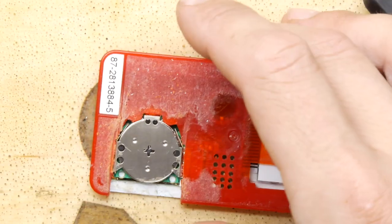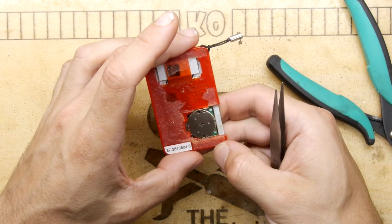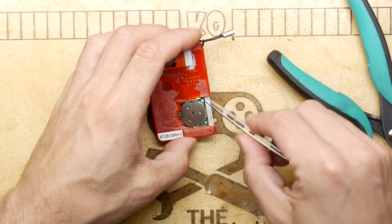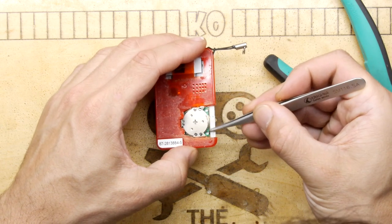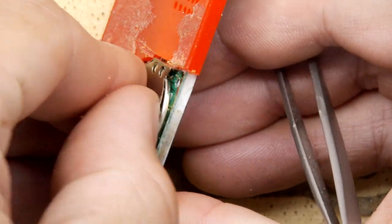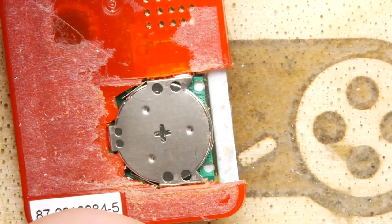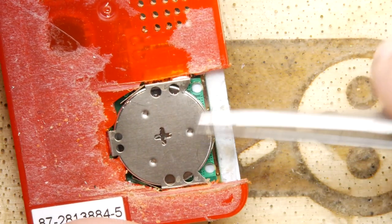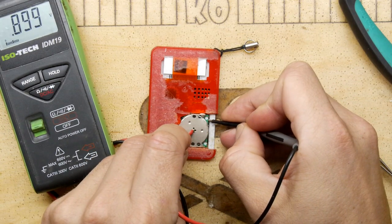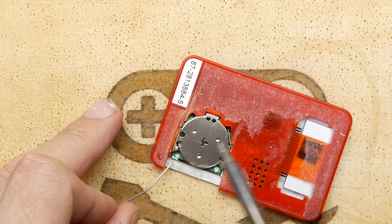Now we're really getting there - it's all a bit sticky. Look at the battery there: you can see the positive of the battery, and underneath the negative. That rail here is probably negative - it would be very odd to assemble it in a way that shorts the battery out when pushing it in. So if you're going to apply power you could probably just apply it between here and there. In fact I'm going to solder some wires on just to see if we can power this up from the bench. But first let's do a quick sanity check on the voltages - it's barely managing a volt.